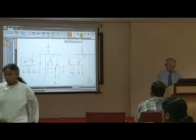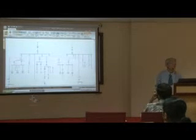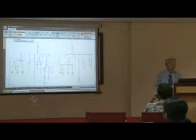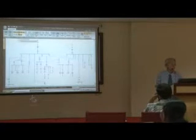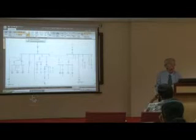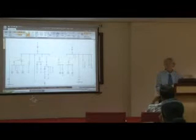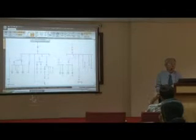Power flow, let's look at power flow. You're going to solve it. Okay, you can look at that one. It'll display the voltages on power flow. It'll display the generators. It'll give you the motor and load data. It will give you different branch flows and transformer taps if you need to do it. And then you can go with power flow. You've got power factor options. If the power factor is bad, and it is bad in this because I have no power factor correction. Maybe I should have a capacitor. Maybe. Anyway, you can calculate that. You can text reports and a whole bunch of other things.